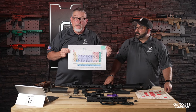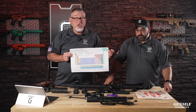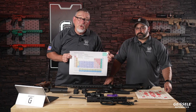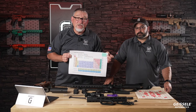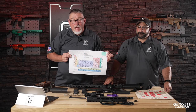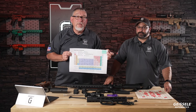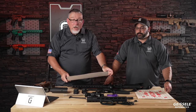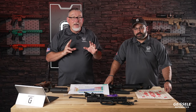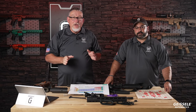Now there are other coatings, like nitriding, which is a good coating. It's very economical to use. It's a lot easier and cheaper to put on. It's corrosion resistant. It doesn't change the size of your gun barrel. Chrome does. Chrome goes on about 7/10,000ths of an inch. And you have two options for chroming a gun barrel. You can make it to size, electro-etch the material away, and then replace it with chrome. Or you can make your gun barrel oversize and shrink it down with the chrome. However, this is not a fully developed process, and there can be mistakes and issues.